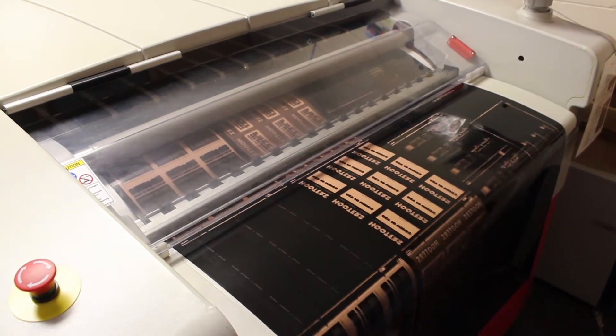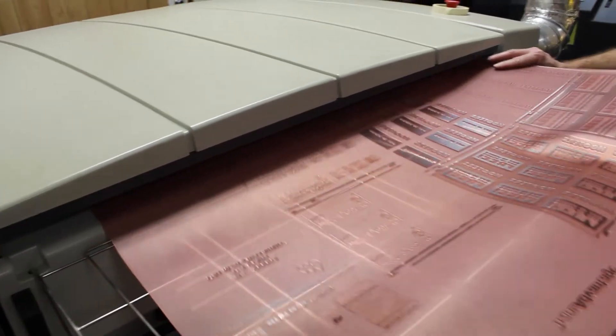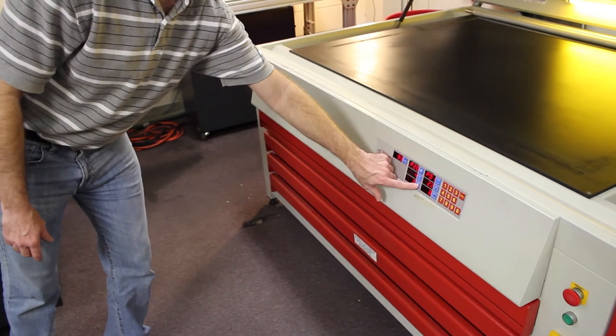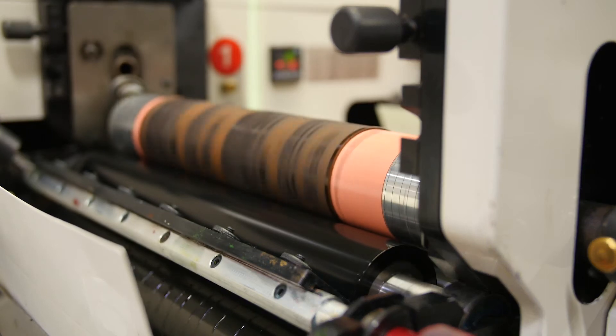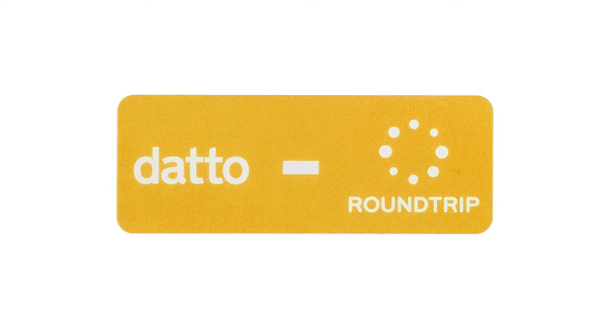This relatively new process uses a Cyrel digital imager, or CDI, that is specifically designed for HD Flexo printing. It works by combining high-resolution imaging at 4,000 ppi through high-definition optics inside the CDI. With this technology, we can create printing plates that produce smoother, sharper images, more intense, consistent ink laydown, and a wider range of color tones.